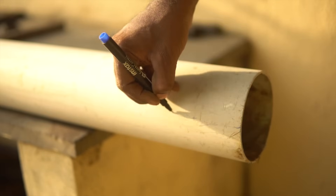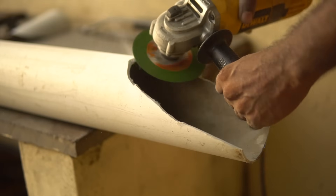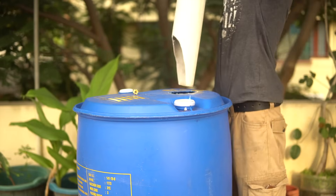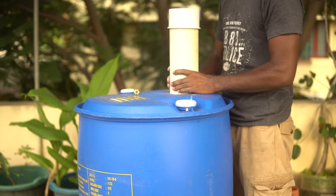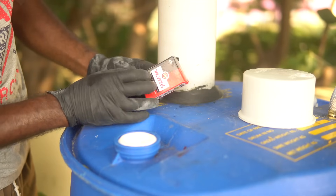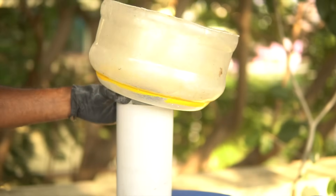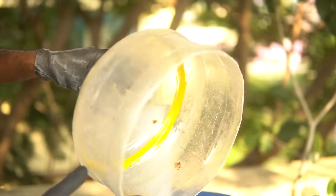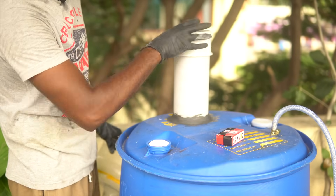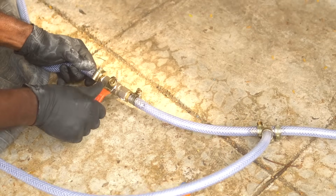The other ball valve connects to the gas outlet on the barrel via a long hose, and the remaining free ball valve can be connected to a burner using another hose. I then worked on the 4-inch PVC pipe, partially cutting off one end so the bottom is open but can still rest on the base of the barrel when inserted through the drilled hole. Finally, I used generous amounts of epoxy putty to seal all joints and make everything airtight.